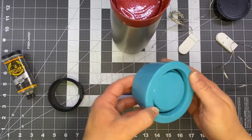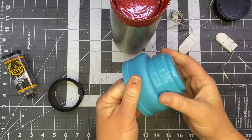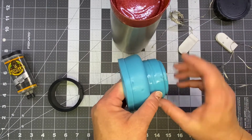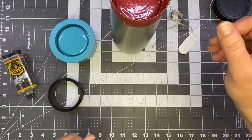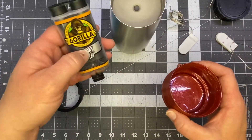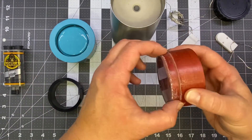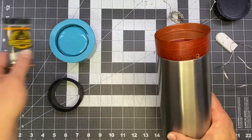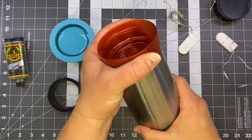This is the mold that we designed. When unmolding this, we recommend just flipping the whole thing over, and then that piece will pull off fairly easy. You can see we've already got the spot there for that hole, so you don't have to worry about drilling. A couple of things we recommend when you go to put this on: we like to use a little bit of Gorilla Glue epoxy, just put it around the bottom part, slide this in, and let it sit for about 15 minutes. That gives the epoxy time to set up so you don't have to worry about this moving.